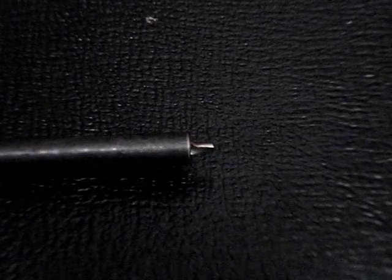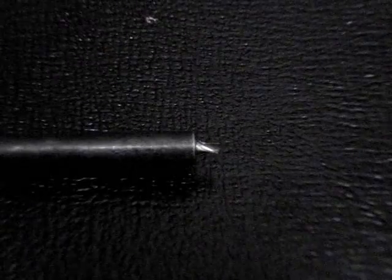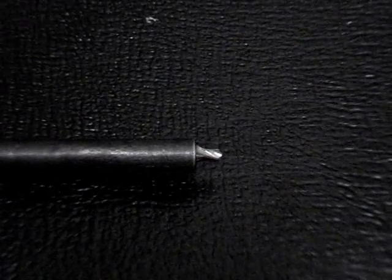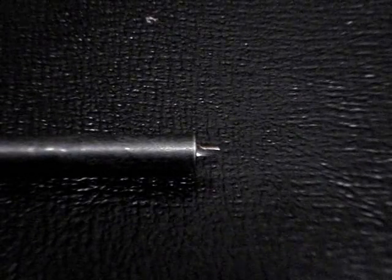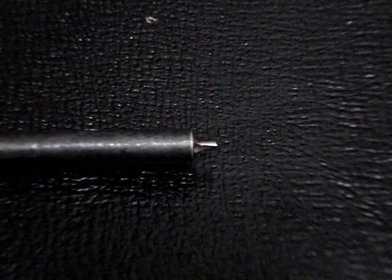Here's the cutter on the flash hole uniforming tool. You notice it'll cut like a little nozzle on the inside of the case in order to direct the flash from the primer, directing it to the powder, not in any angles or in any inconsistent way.